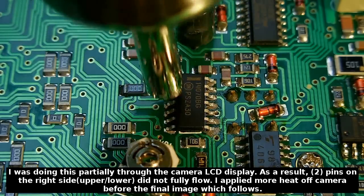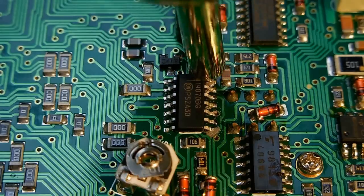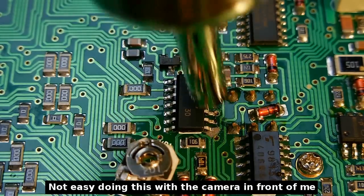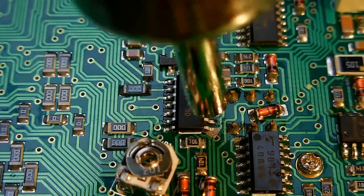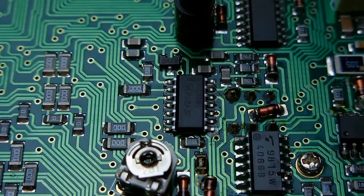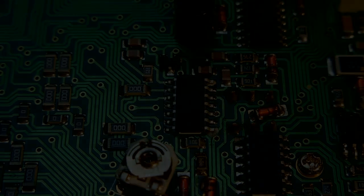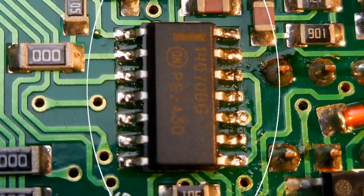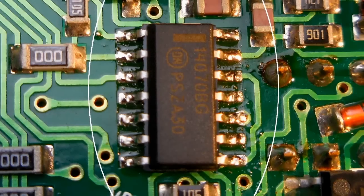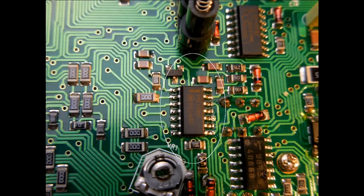Moving up and down each side, you'll see exactly when the solder starts to flow. Going up and down both sides — and that's it. I'm going to take a closer look to make sure there's no bridging, and then give you a close-up image. Here it is, all completed — you can see the IC soldered very nicely to the board. If you enjoyed this video, please rate it a thumbs up, subscribe, and post links to this video on other websites and blogs. Be sure to check out my video playlist as well. Thank you very much for watching.